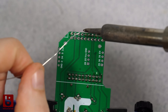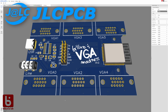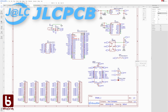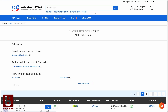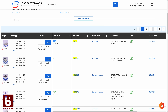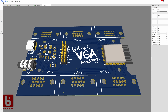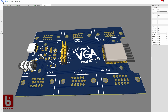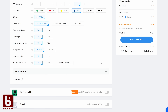The previous boards I designed were solder kits which required soldering the pin headers and didn't include the actual microcontroller. This time I wanted to test JLCPCB's improvements on their assembly service — they offered to sponsor this project and I took the opportunity to get a better version of these boards. EasyEDA, the design software I'm using, is connected to JLCPCB and LCSC, the component provider, so I could pick parts available at LCSC. I tried a USB-C design this time and put the serial interface and the ESP32 module directly on it, so it's a fully featured board.